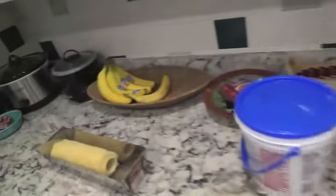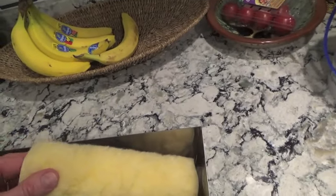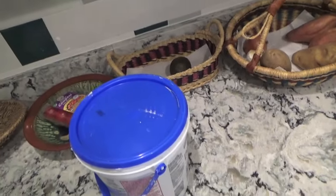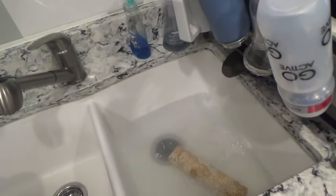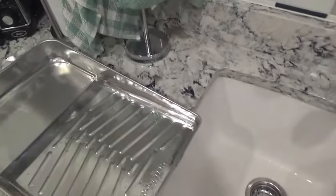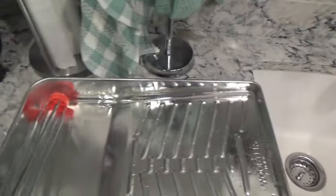However, by the time I got the plaster rolled out, it had been so long that it was softening up the underlying patches of plaster that were in the ceiling. That happened in selected areas that had been patched, so I went back and redid it. But then again it took a little bit too long because I said, well, let me retouch this area because it needs a little bit more texturing. And then I had the same problem — pieces were pulling out from underneath. So the working parts are this regular sort of paint pan, the roller mechanism, and then a texture roller.